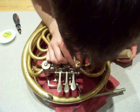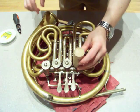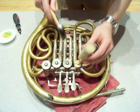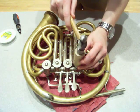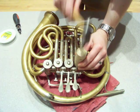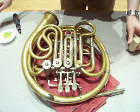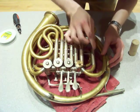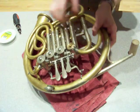Make sure our notches are lined up. What this dowel allows us to do is to apply even pressure over the entire bearing plate when we tap the valve back in. I'm going to tap lightly, oh, three or four times.